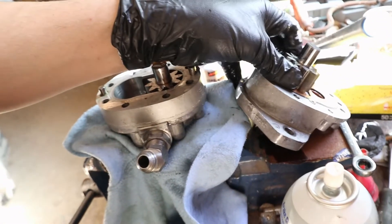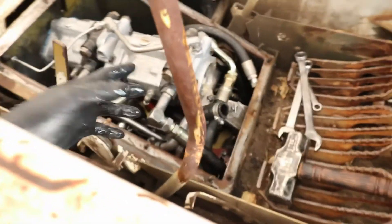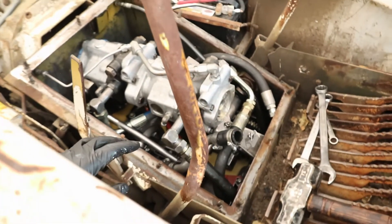There are a couple springs in there — I'm not sure if that's just to hold pressure on the side plate. The shaft looks good and seems fine. I don't know — there's got to be another problem. Maybe it was pulling air in through the suction side since that wasn't overly tight. I might have to buy some new hoses, or there could be another relief in the system going over. I'm going to have to look into it more. This is just a quick update for you guys — once I figure out more and we actually get somewhere with this, I'll do a full video explaining what I find. Thanks for watching.